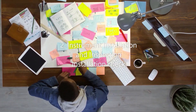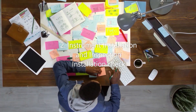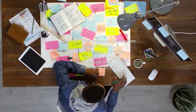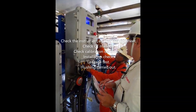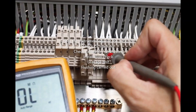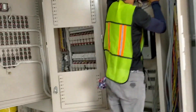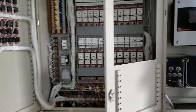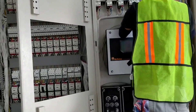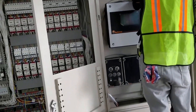Instrument Installation and Inspection Installation Check: Check the instrument against the data sheet, check CE marking, check calibration certificates, installation check, leakage test, and flushing carried out. Example checklists include: Transmitter leak checklist, Process switches checklist, Bed controller checklist, PLC digital input checklist, and Instrument installation checklist.